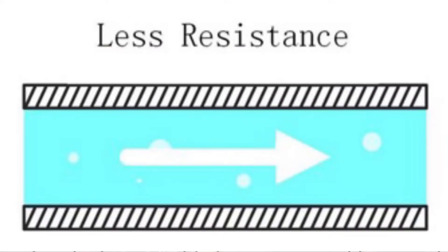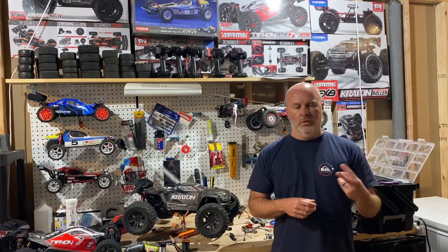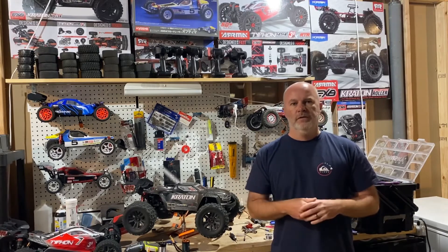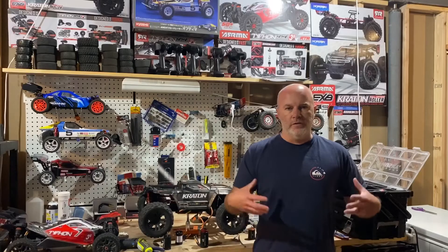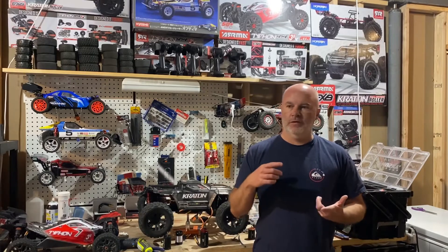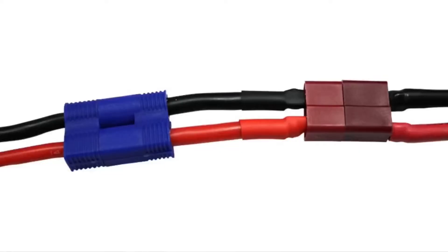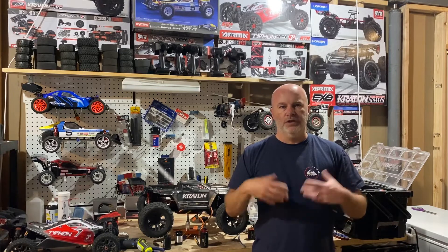What are these two concepts? First, when electricity flows, it encounters resistance, and when it encounters resistance, it creates heat. Number two, the more electricity flows, the more resistance it encounters and the more heat is generated — so those two things are directly proportional. More energy flow, more resistance equals more heat. These are internal resistors that are part of your components: kinks in your wires create resistance, the wires themselves create resistance as electricity flows through them, connectors create resistance when electricity jumps between them, and other components all build up internal resistance generating heat.